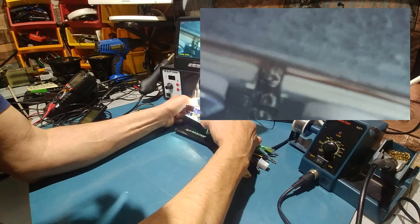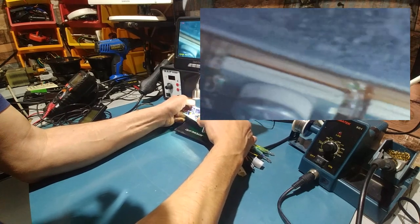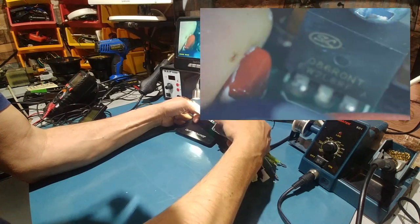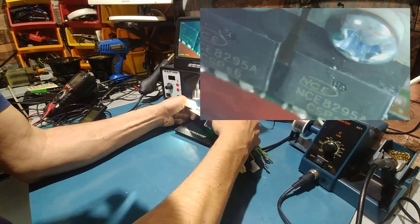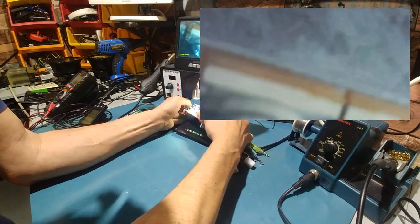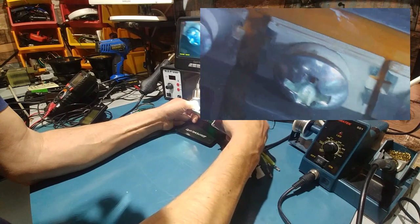And you can see the gap there on that FET. Another gap there. No gap, no gap, gap. Those are all the loose ones. Another loose one there. And I don't know if I can show it, but this is not normal. Look at that. SC, and you get the model number. Different, dirty. You get the idea. It's been modified for a while, and you can see fingerprints on the actual screws themselves. It's not factory. So that clears me.